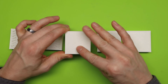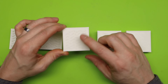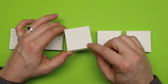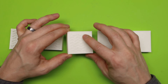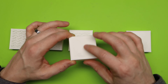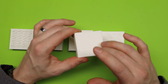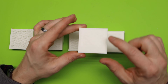But then you get into three. Three is usually when I hear people having a top layer issue — they're at three. That means it's put three layers on, it's covered up those holes, but you can still see the infill. And sometimes you get these raised bumps or pits, and that is called pillowing. So if you have some of these issues, I recommend trying to go up another one. Four is very nice, but there are certain areas you can still feel some of the actual infill. That's why I always go with five. Five is super smooth — I can't feel anything here. It's just a good, clean print.